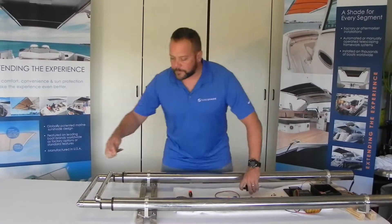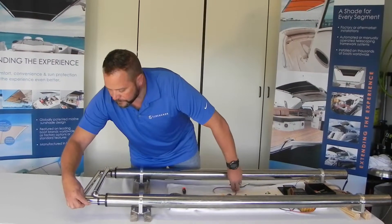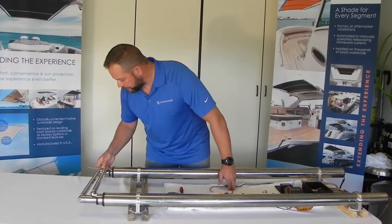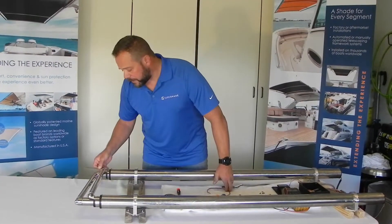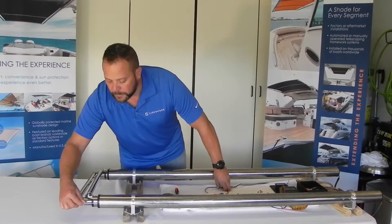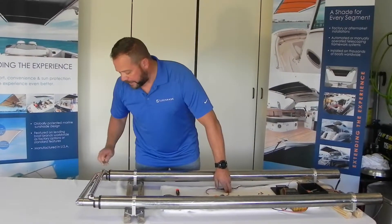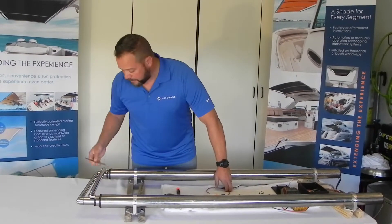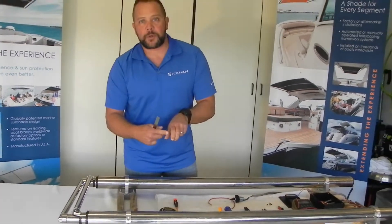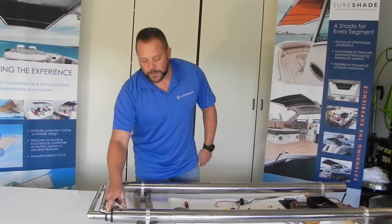So right now we're going to go in. There's one and an eighth. This one retracted a little bit further than one and an eighth. So right now our port one — there's our inch — and we're further than an inch here. As you can see, the two different measurements. That's usually due to the magnet that's on the flat wheel of the motor — there's only one of them, so every 360 degrees of rotation it counts.